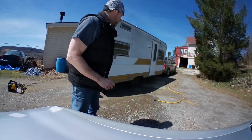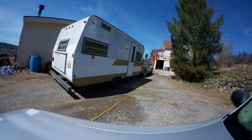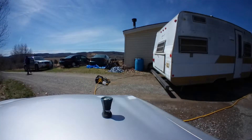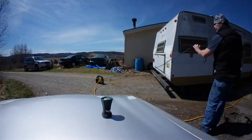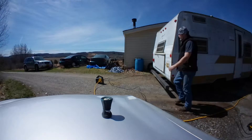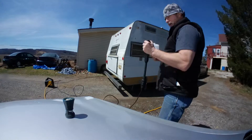When you are hooking up your water hose, run your water hose before you hook it up so you can get the air out of it. I've got a lot of hose — probably 200 feet — and I didn't let it run to purge the air. So when I turned it on, it was intermittently sending water into the pump, causing the pump to run, then shut down, then run again when it gets air in the hose.